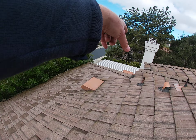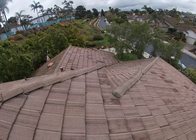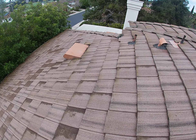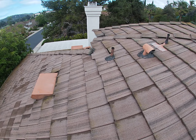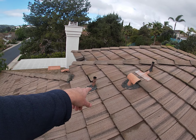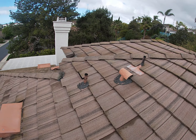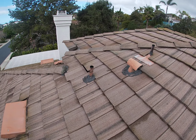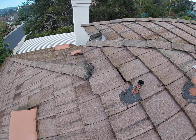We've got attic ventilation — that's what these big boxes are. There's one over here on the garage. I can see some of the pipe flashings, and the T-top on this pipe I can't see. These look like maybe they're the original flashings, but coated in mastic, which means probably there was a leak or something going on, so they fixed it.